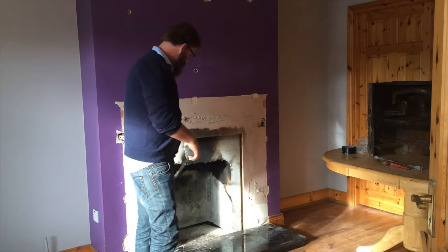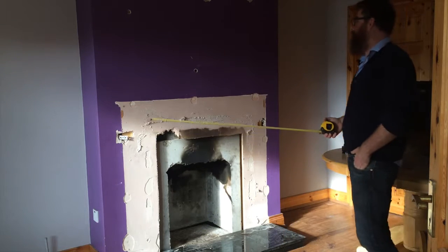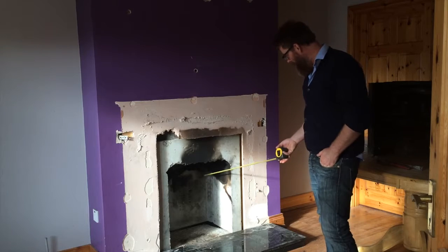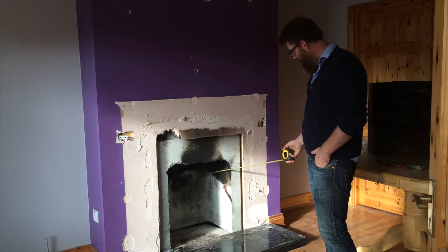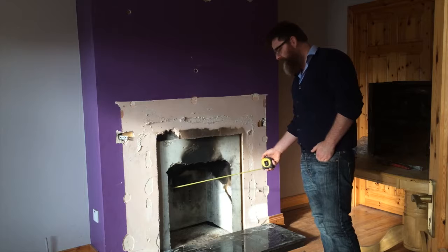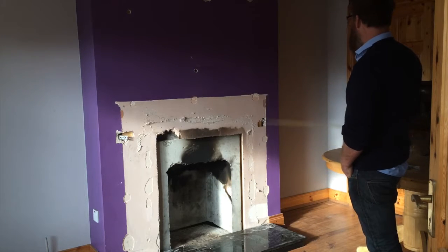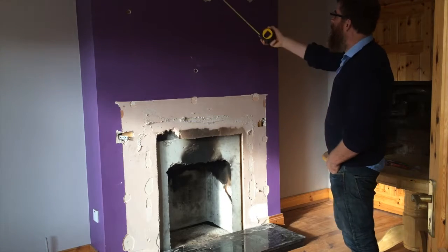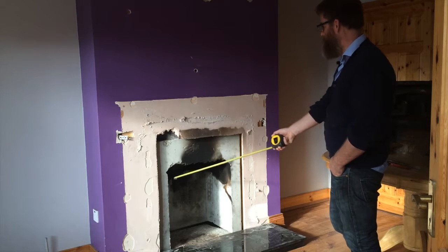So this back boiler is going in here. So if you try to visualize that sketch that I had just after showing you, basically she goes in there. So I'll have to drill a hole there for my flow, my return, and this will be for my feed. So 2 pipes are going to go up here, and they're obviously going to continue on up through the story above me, and a 1 1/2-inch pipe is going to come down here into the side of this.